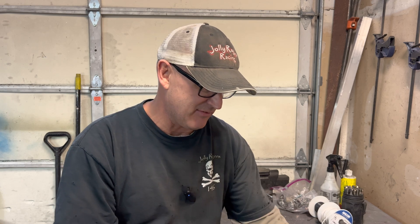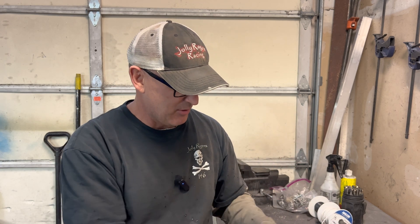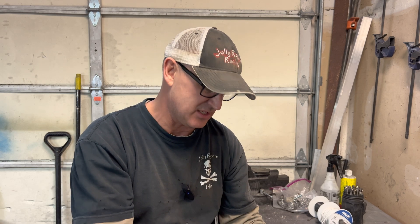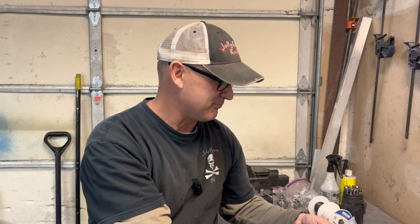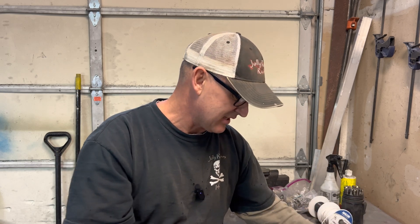I'm not advanced enough yet to do all the fancy ends on watertight pin connectors, but what I do use is a bag of non-insulated stainless steel high-temperature butt connectors. They're stainless steel and they don't have all that crappy insulation around them like the cheap ones from a hardware store. They're nice and small, which allows you to put heat shrink over the entire joint — adhesive-lined heat shrink. These are Morris, right off Amazon, and I really like those.